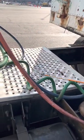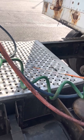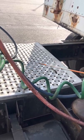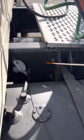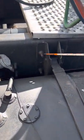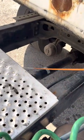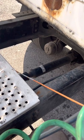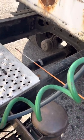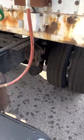This is a catwalk. When you check the catwalk, always the same thing as the steps — no oil, no grease, no slippery; it should be tight and secure. We have a frame — the frame is no cut, no cracking, also not illegally welded. In the middle here, we have a driveshaft. Driveshaft has universal joints — the universal joints are always greased and lubricated. Make sure the driveshaft itself has no cut, no cracked, no broken, and also no illegally welded.